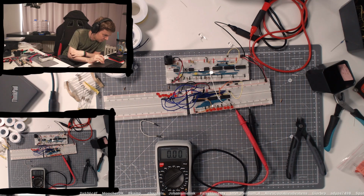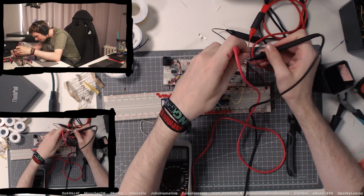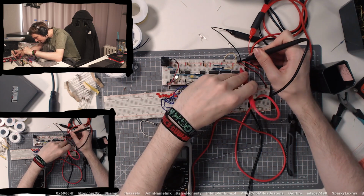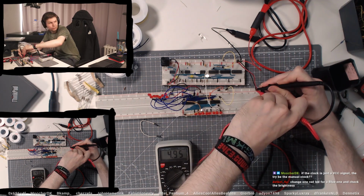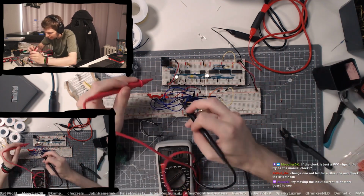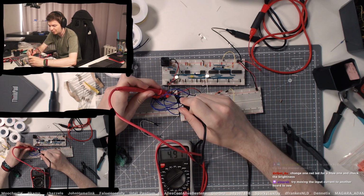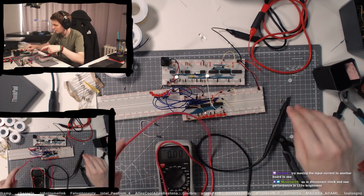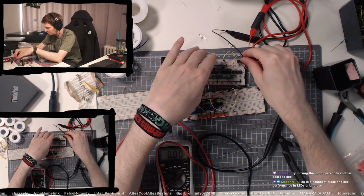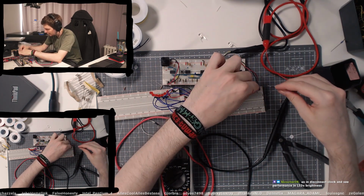Yes, it looks like it's powered, but there's too much voltage drop over the boards. Okay, so right here, when the wires are coming in, I'm measuring 4.9 on this board. I'm also measuring 4.9 here, and on this board then 4.9. But see how crazy it dropped? It was 4.98, then here it was 4.95, and then over here it's 4.99. Put the input current to the other board. Okay, let's put it over here. I short circuit them. Good job.